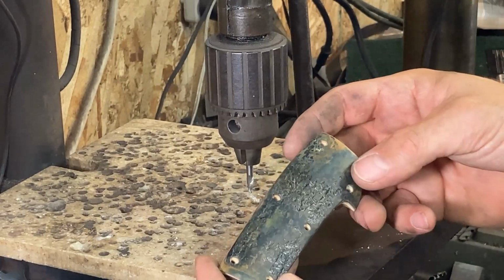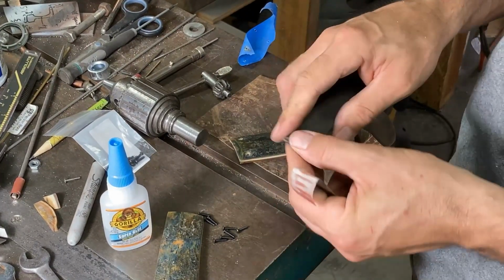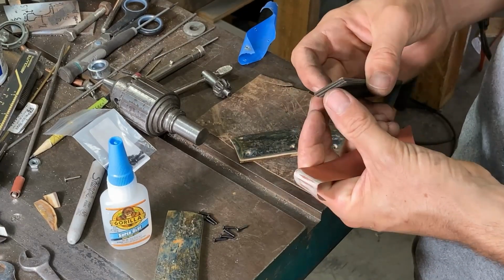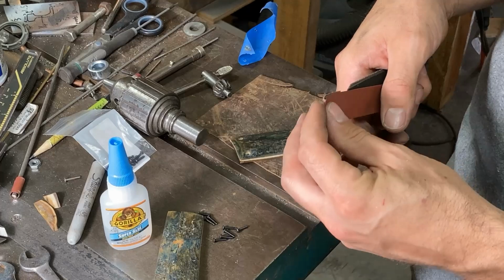So now I've got one of my rubber sanding backers. It's a chunk of baler belt with a finer point ground on it, or like a chisel edge. I use this a lot for detail sanding, blending. Piece of 1000 grit Rhino wet paper.